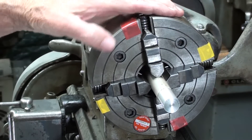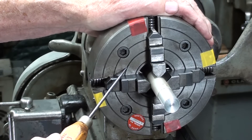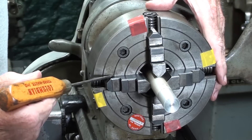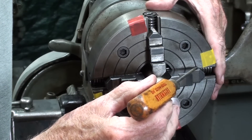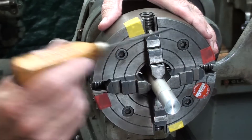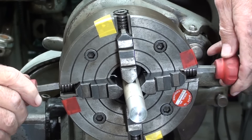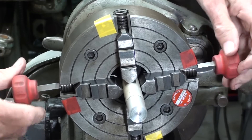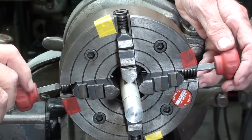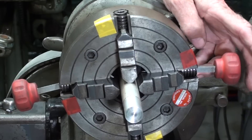Whenever you set work up in a four-jaw chuck, we make initial settings trying to get it fairly true by using the concentric rings right here. I will set these two jaws so that they are in pretty much the same location — that is, this amount here is very close to this amount — and same thing with the red side. Strictly by eye; we're not using an indicator yet. I'm moving the work back and forth with the two jaws, working in the red axis and then the yellow axis. The work must just be snugged up — do not tighten it yet or you're going to have trouble moving the work around.